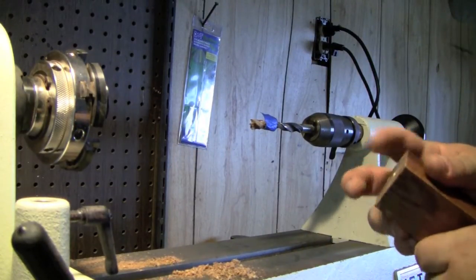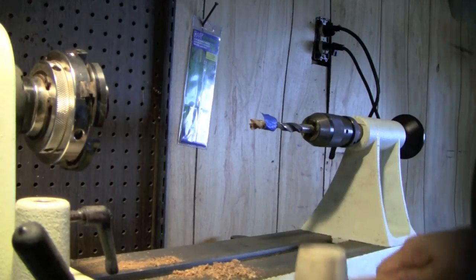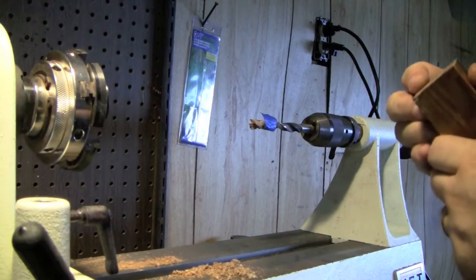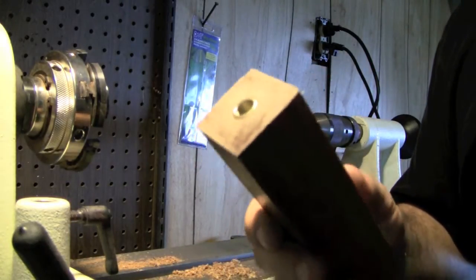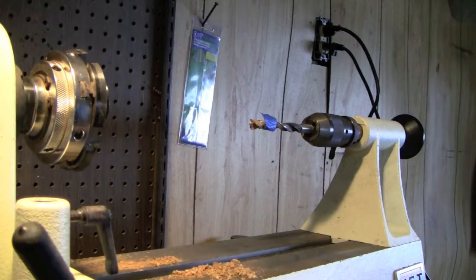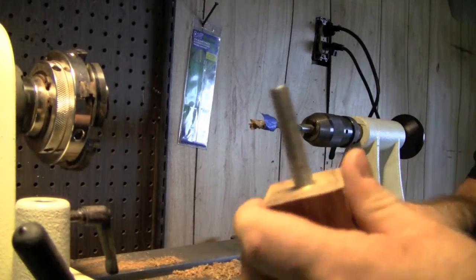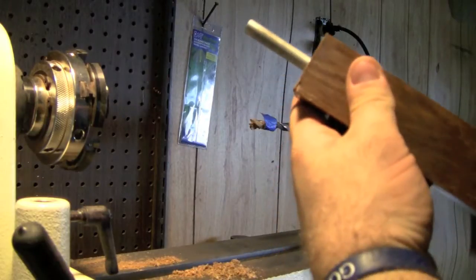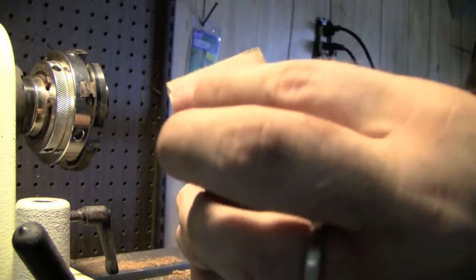And this is a pretty good fit. It's not absolutely perfect. I might be able to get that in a little bit more. I'm not sure if the hole is too shallow or if it's because I just can't pound it in enough. So what I'm going to do is take one of those screws that we had purchased in addition to the coupling, and thread that in, make sure that the threading works. That's pretty good. I'm going to pound that in just a little bit further. And yeah, that did the trick. So the hole was perfectly shallow enough. And now we have a nice flush edge with that coupling right where it needs to be.